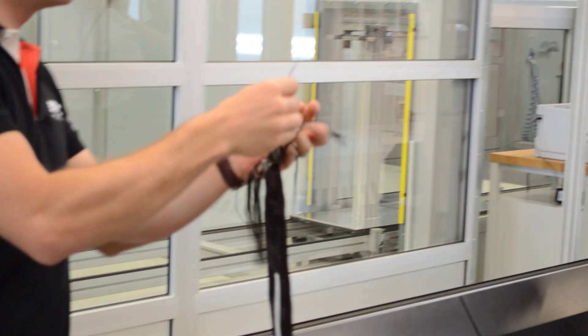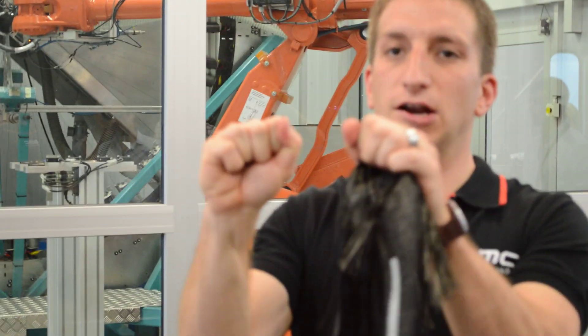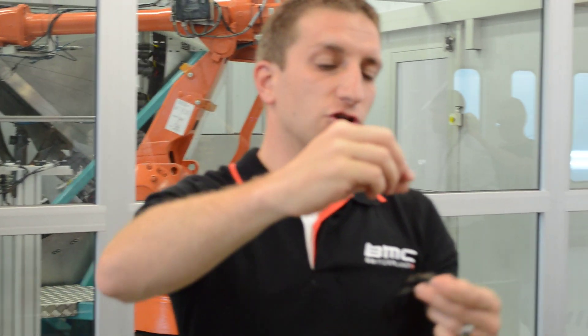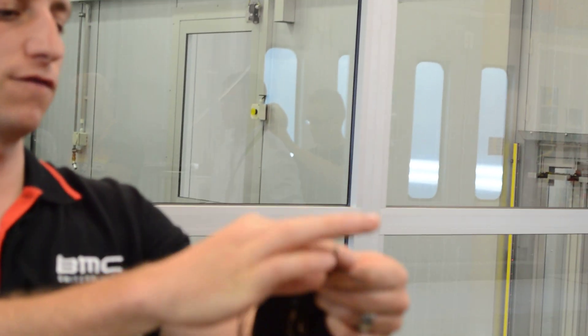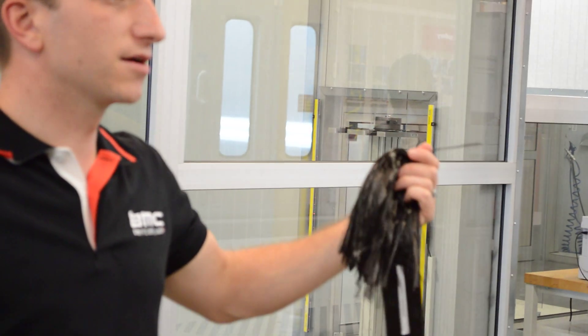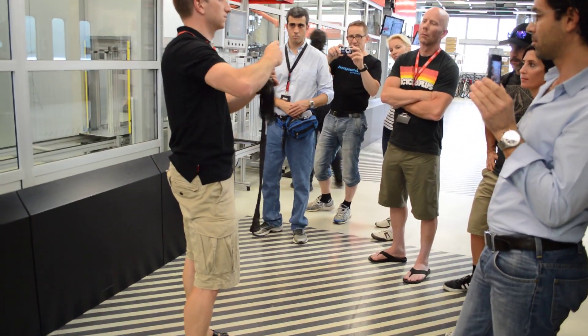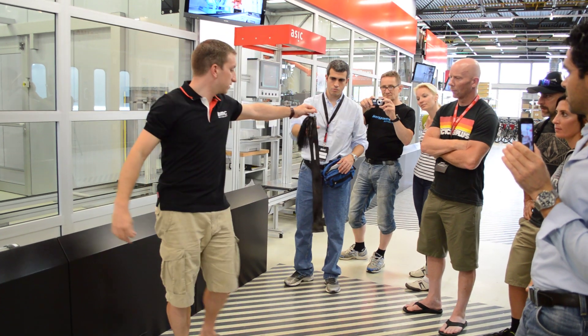For those who have never seen carbon fiber — the special thing about carbon is that it can only take load in tension. Very simple to show: once I make a load into the fiber and it gets a side load, it's very easy to break. You can try yourself. That's why it's very important to have the fibers in the direction of the loads — that makes the strongest composite you can have.